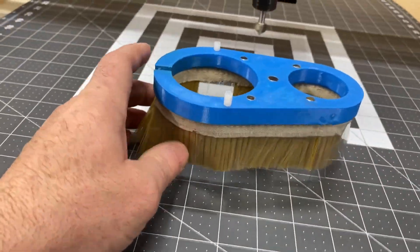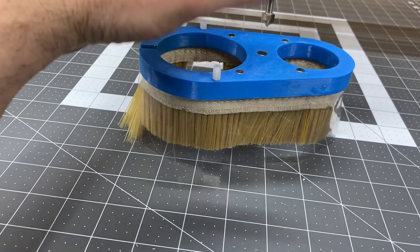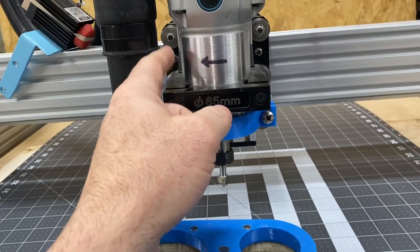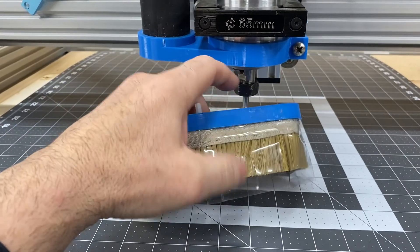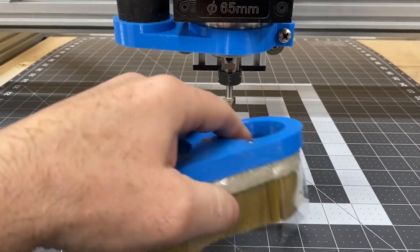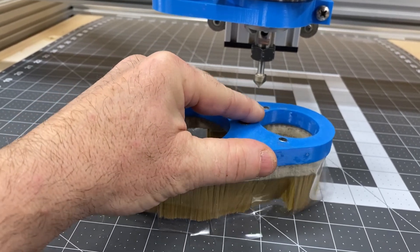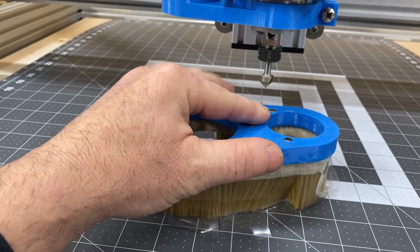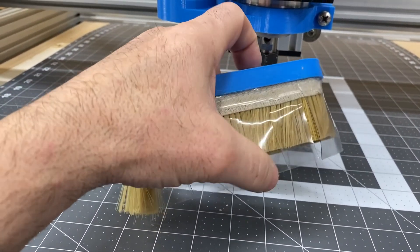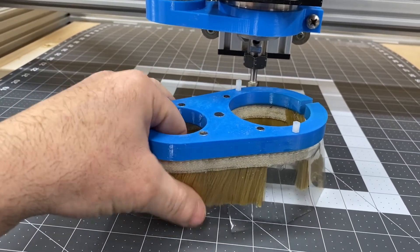I have not seen any dust sneak past this unit, so I'm pretty proud of how well it works. The key is how much clearance I give the bristles — the bristles form a sturdy foundation and are hard to press down, which adds stress to the router on the Z-axis. So I cut the bristles shorter than my intended route depth, staying above the bit, and rely on the vinyl portion to do the primary dust collection. I get about three-quarters of an inch of play down before reaching the bristles.